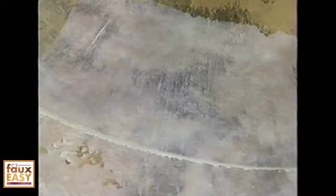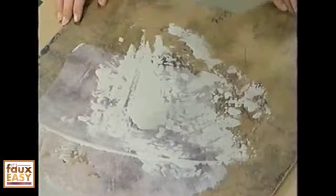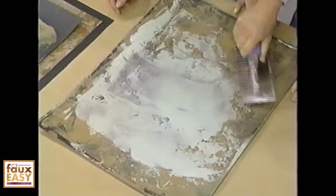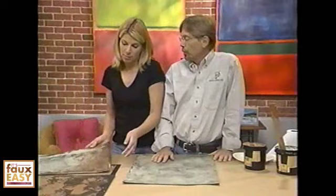Practice will get you to make it perfect. Now see how this is darker here? I may want to add a little bit more material — I'm tapping lightly, listen to how light that pressure is. If I want to take it off, the pressure will be hard and it will move more. Pressure is key on faux finishing — the lighter the pressure, usually the more material is left on the surface. Can you overwork an area? Absolutely, but faux finishing has nuances — you can work an area for a long time but it's not cost-effective. Just do it and move on. Usually work in a two-foot by two-foot area; as you get more comfortable, expand to four-foot by four-foot.